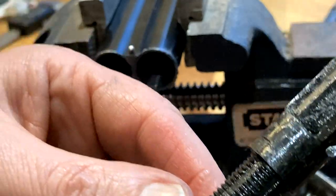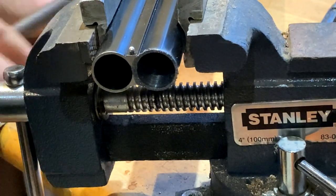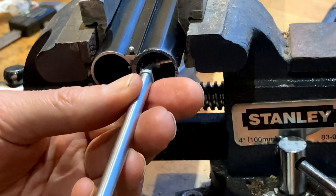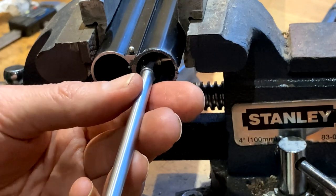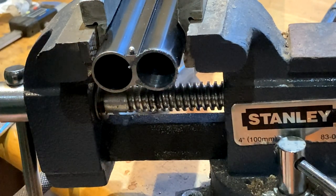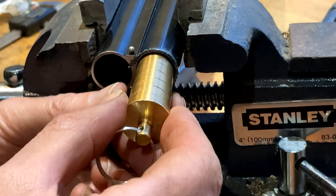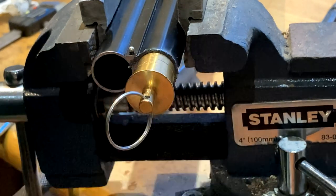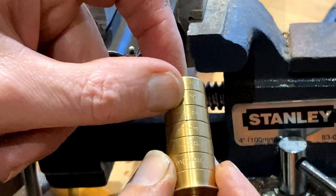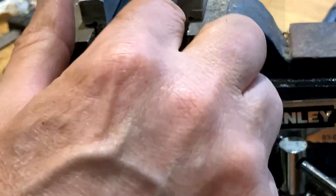And that's what I'm talking about when I say that's a good cut. Now you can see a good cut. There'll be swarf and whatnot in here, but now we're getting to it. That's approaching the right size now. I'm only halfway through, but we're at the right size again. This is full of bits, but if I now offer this up, it's just starting to touch on improved cylinder. So we've gone from half to quarter, and now we're just touching on improved cylinder, which will be the new choke size for that one.